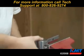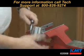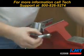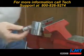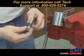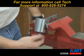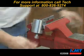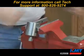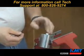On the assembly procedure, put it back in our vise. Put our position tool inside our gland nut. Push it up in the bottom. Thread it in, just hand tight. Take our seal installation tool, position it in the top of the valve body.